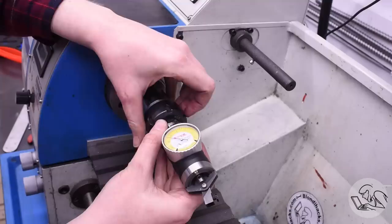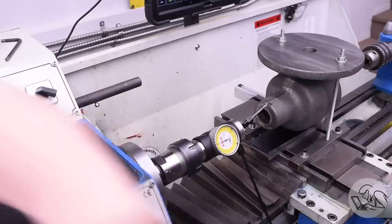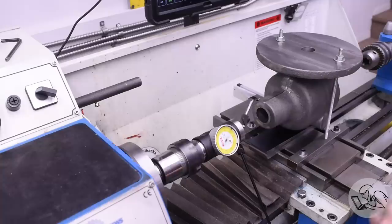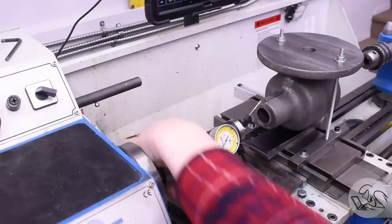You can use a DTI on an arm just like we did on the mill for this, but on the lathe the coaxial is a lot easier because you don't have to try and see the indicator upside down. So I'll get this thing adjusted so that we get a reading all the way around. Normally with a coaxial indicator you spin it up slowly and adjust the handwheels in real time until you get the needle to stop moving — that's kind of the secret sauce of these things. However, with a casting this rough and misshapen, it just doesn't work; there's too much erratic movement and you can't really see what you're doing. So instead you can use it another way: move it by hand and just sample the part at different positions. I can check the far side — that reads 10 — then the near side — that also reads 10 — having moved the cross slide back and forth to get those values to read the same.